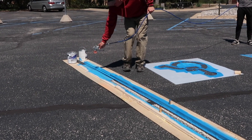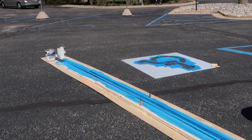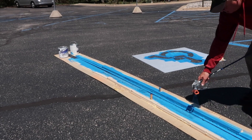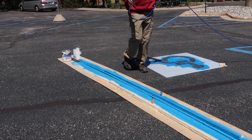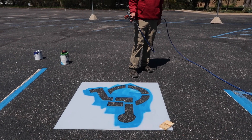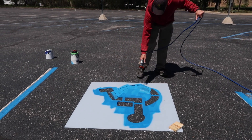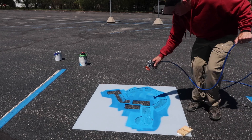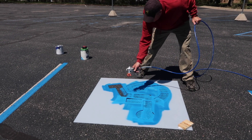On the next line I'm noticing I need to be a little bit closer to the ground, so I'm bending down a bit further. I could get a spray tip extension which would probably work better and be easier on the back. Here I'm working more efficiently spraying the stencil — I've got to curve around with it a little more, moving my wrist quite a bit to keep with the line, but overall I'm not wasting paint.